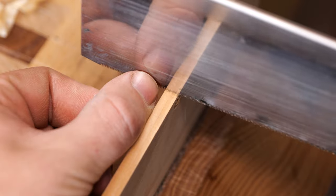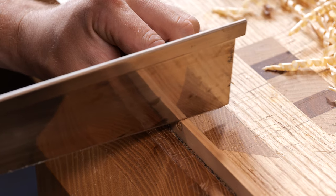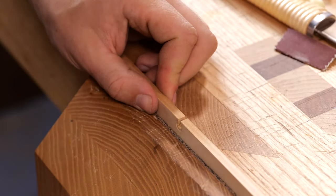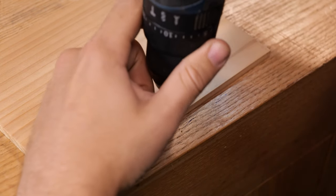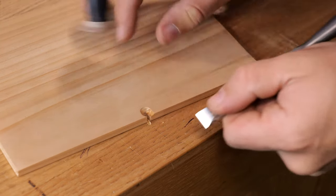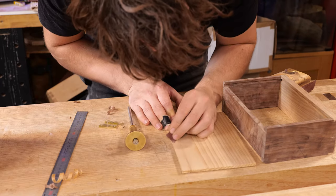Square those along the top and cut right up against the edge of those lines with a nice fine saw — I'm using a Japanese saw for this. Then we'll get a little countersink in there just to clean up the edges, and give it just a little bit of sanding to smooth it out. Cedar doesn't really take hard chamfers very well so I've got to kind of round this, but with a harder material you'd probably have better luck.